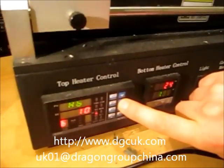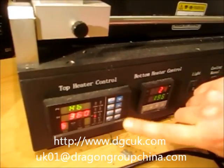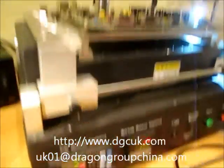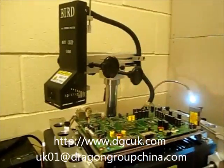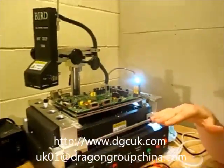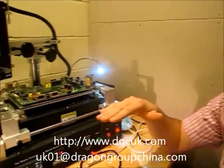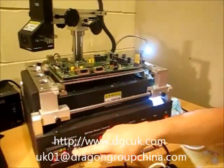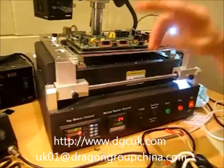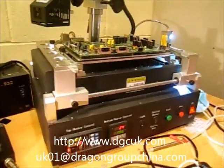And I know we keep that quite high. Basically, what it means is — the way it works is if the top heater will only allow itself to go one degree above what it should go. Whereas if that's set to a higher number, it will allow it to go higher, which means it will get hotter quicker. And otherwise it will take too long to catch up.